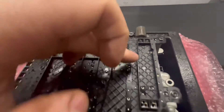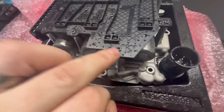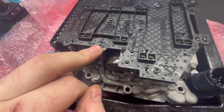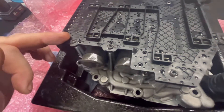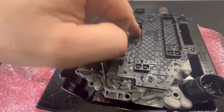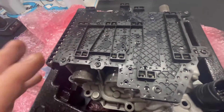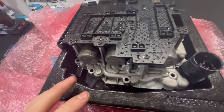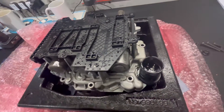And these are your pins. What we're going to do is just double check that nothing's bent, which fits on nicely. These get torqued up - it's about two Newton meters, reading the specs, and then a couple of degrees, and that's done. They do get torqued up in a set order, guys - don't just bang them in and out - because the contact plate needs to go down completely flat.